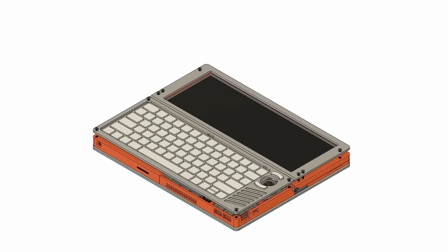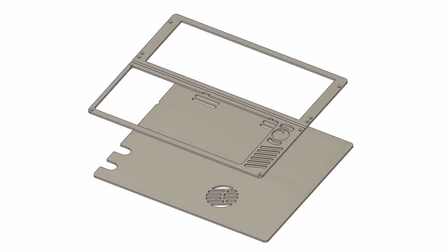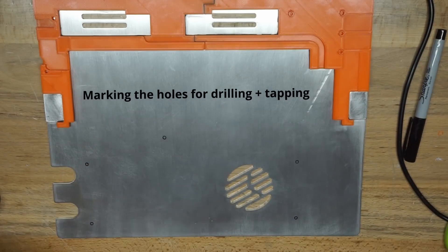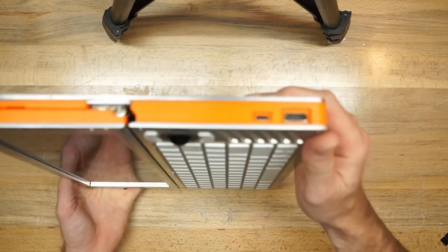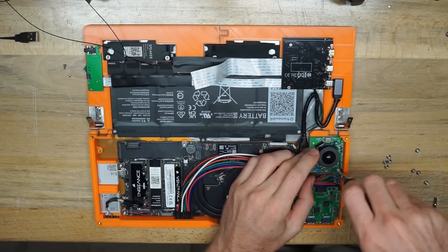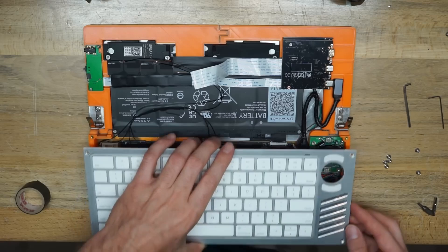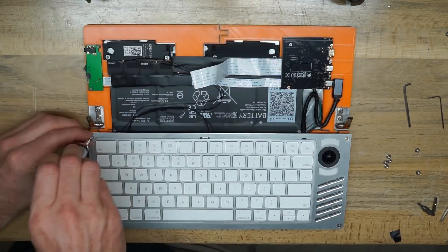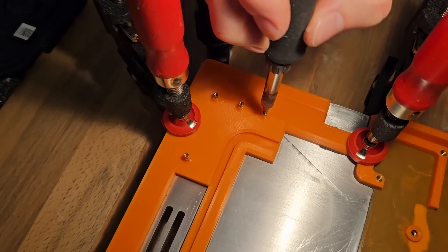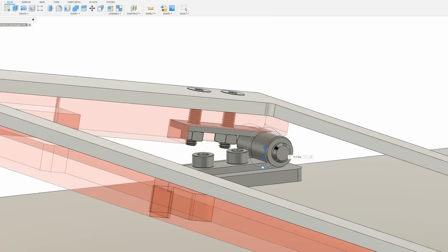The driver for the screen also includes an extra input you can use to connect and set up a Raspberry Pi. From a design perspective, Ben demonstrates a bunch of techniques worth noting. First is this sandwich of CNC-cut aluminum plates for the top and the bottom, with a 3D printed plastic framework in the middle. This provides a super polished look on the outside while leaving all the interior bits to your 3D printer. Creating this sandwich in a way that remains serviceable required a mix of fastening techniques: JB Weld for the bottom plate, threaded inserts for removable sections, and a pair of friction hinges for the screen.